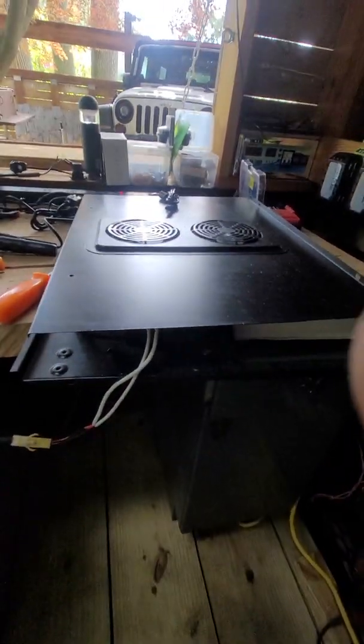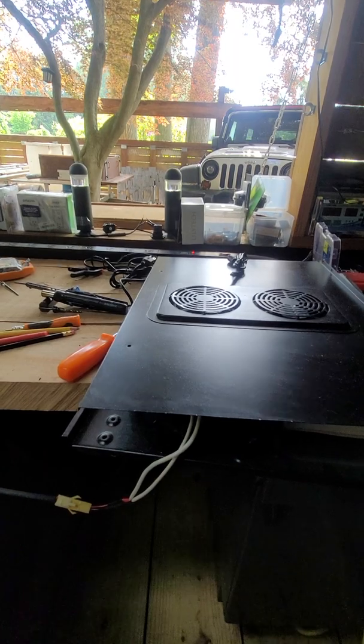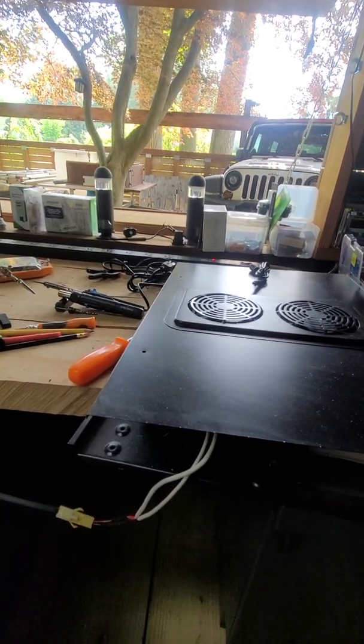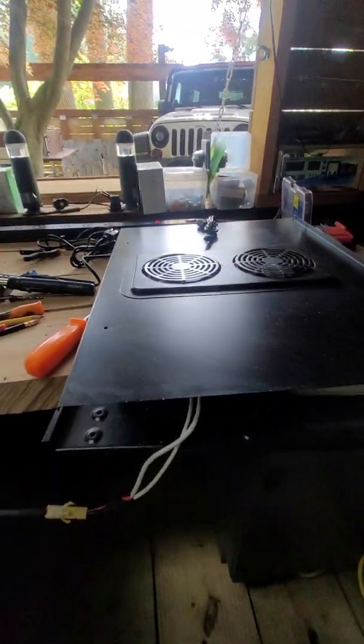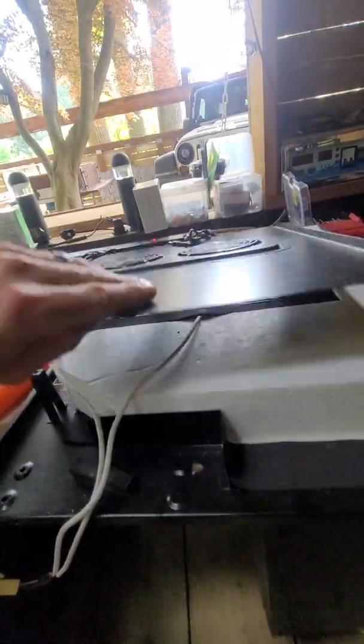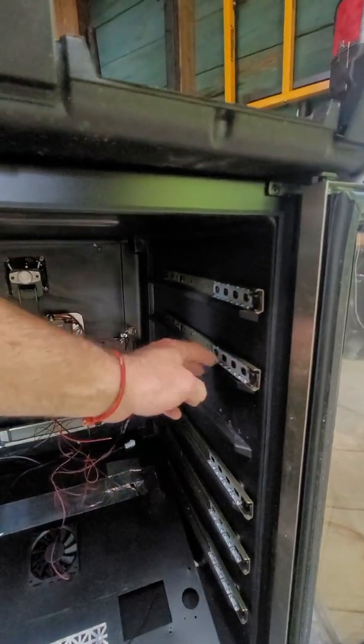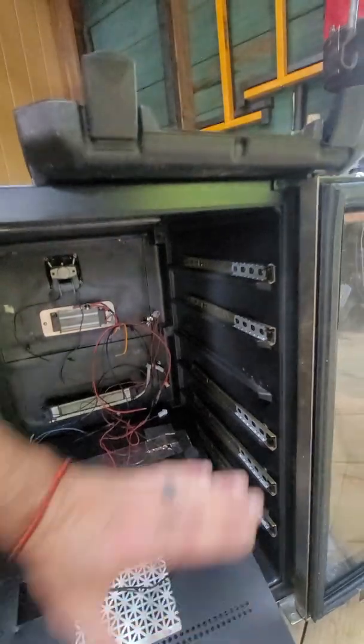It's wedged in nicely inside this inch-and-a-half-thick insulation. This is the center plate that separates the top and the bottom — the idea was red wine kept warm on top, white wine chilled on the bottom, which is why there's a 100-watt heater on the bottom. Looking in here, this sucks the air from the top and the whole unit fits right in the middle rack where you see the trays. The controls to change the temperature were on that little face plate.